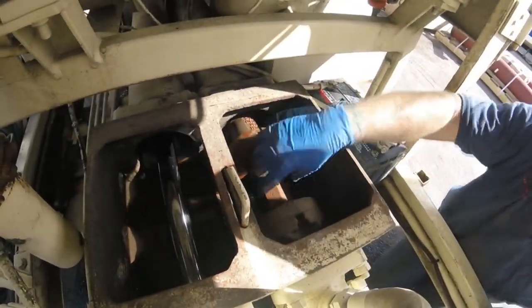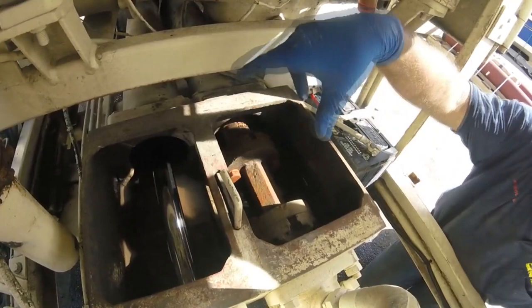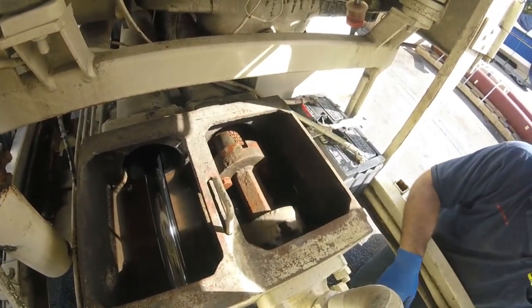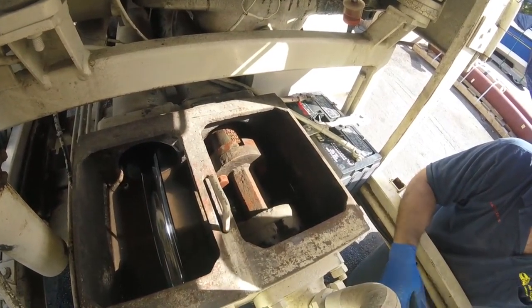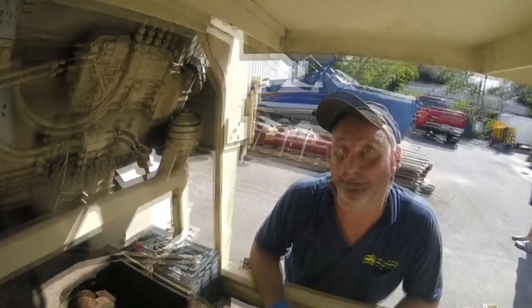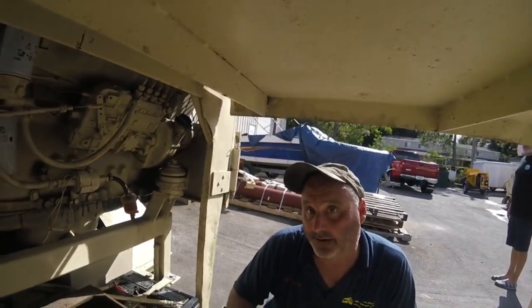You take these four bolts off, you take the dog bone out, you slide it up, put a rake on it, and pull it back, and it'll pull the piston out. Real simple. The first time you do it might take you about 2 hours. After that, it's like riding a bike. You always remember. You'll get faster. I've seen guys do them in 10 minutes.